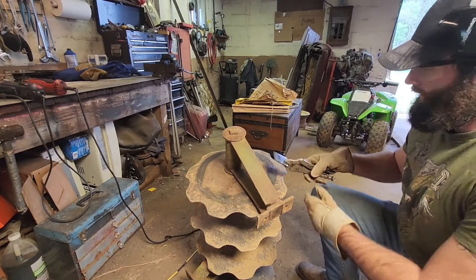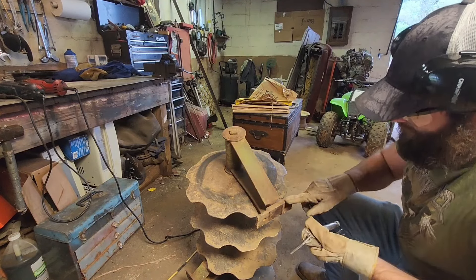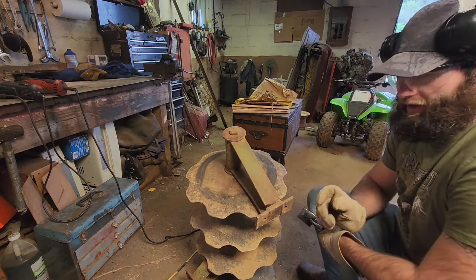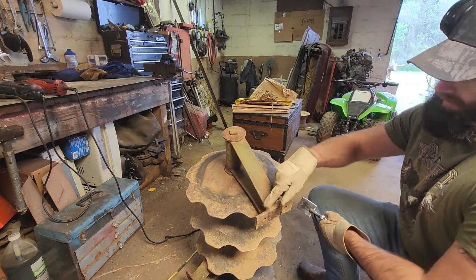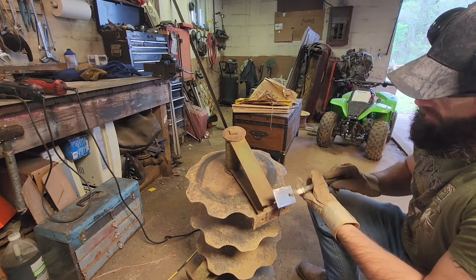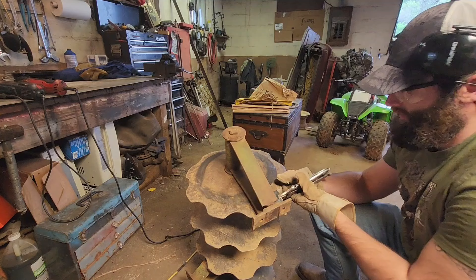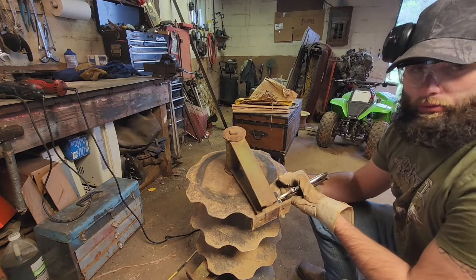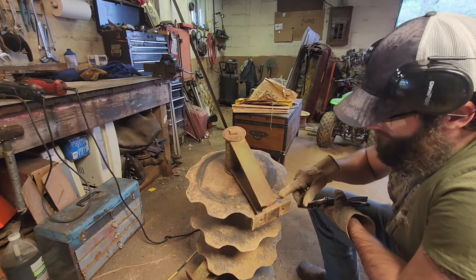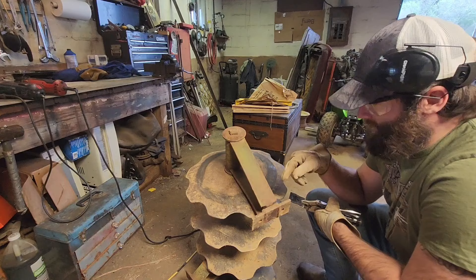Here's what we're looking at right now — that's kind of where we're going to be sitting at, except maybe a little lower once I cut this weld out here. On the back side, you guys can't really see, but that weld is all the way through and on the other side it has a lip that sticks out further than this plate would have. What they did was weld around the front side and back — that's why it has that lip and this won't sit flat. You can see how I cleaned all the sides so it'd be easier to weld, and then if you go to paint it it's really simple — I learned that from another YouTuber. Anyway, we're going to get ready to cut this out. I'm not going to mark anything, I'm just going to rough cut it because we have this backing plate here, so I don't have to worry about trying to fill any craziness.